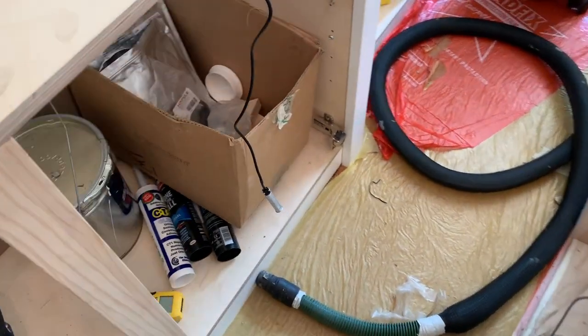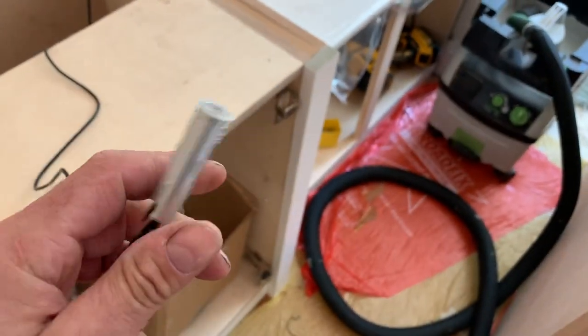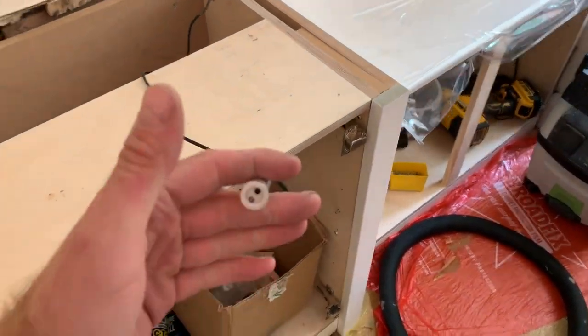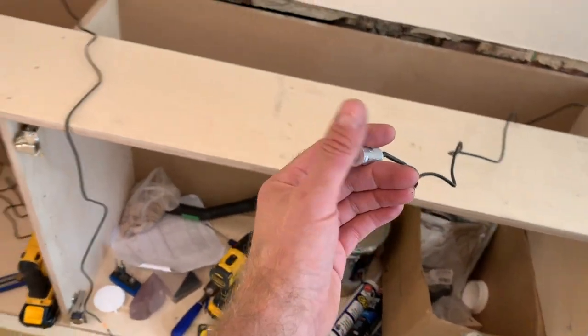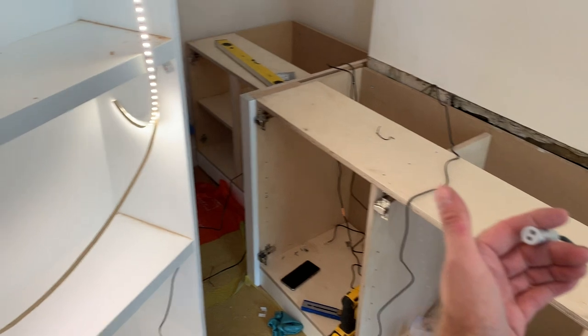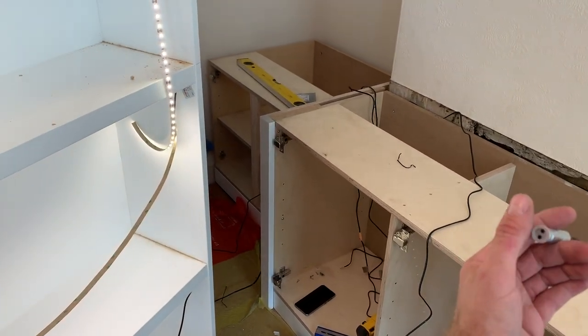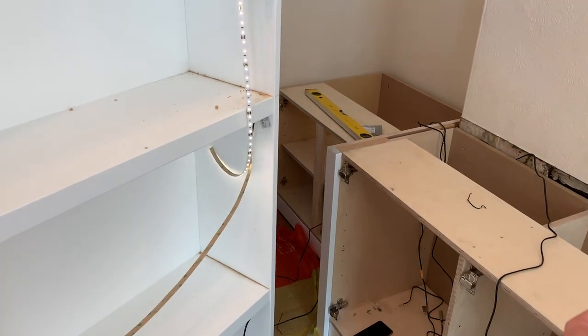And for this job, we're using a dimmer switch. So it plugs in the back there. That'll go into a 12 millimeter hole, and that's wave activated. So if you just wave your hand or finger across that, it turns them on and off. If you hold over it, it moves them through a dimming cycle.